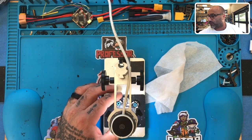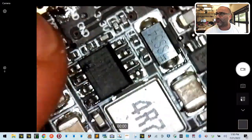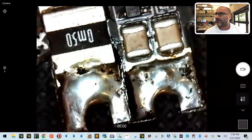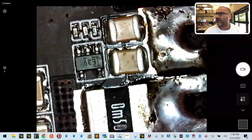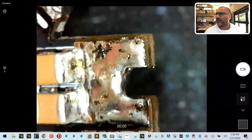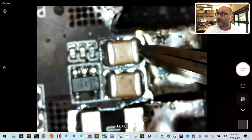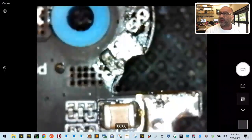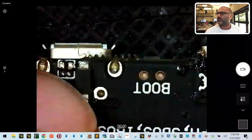The first thing we're going to do is go to the microscope and take a look at what has been done on this board. Some of the soldering is a little bit sloppy — noticeable right out of the bag. We've got a little bit of solder that seems to have jumped up on here. I try to see if we have any solder that has jumped up anywhere. As you can see, there are bits of it right here — flex of it that you can scrape off. Let's look around the rest of the board.